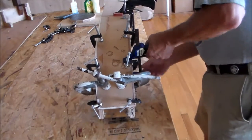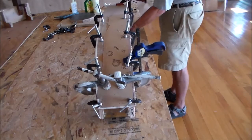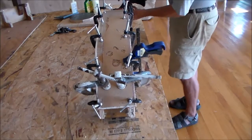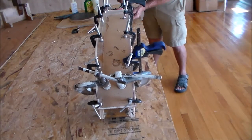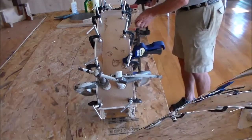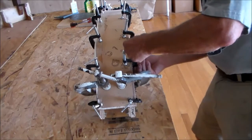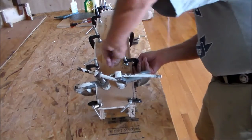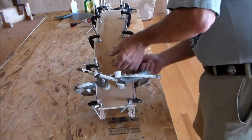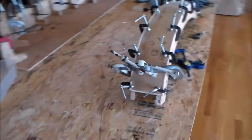As you get further away from that tight bend, it becomes much easier to bend the wood and apply the clamp — this part of the glue-up is very easy. In one area I noticed a gap between the layers of plywood and I'm applying additional pressure to squeeze some glue out of that spot. This one glue-up is going to make two ribs when we split it down the center. We need a total of 12 ribs, so that's six glue-ups.